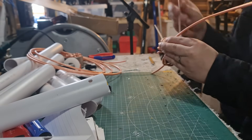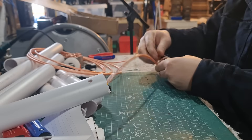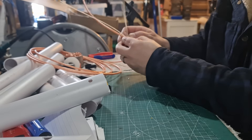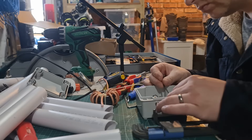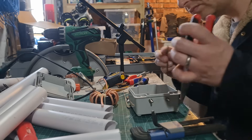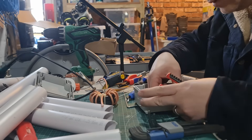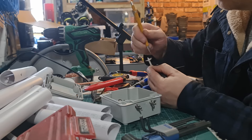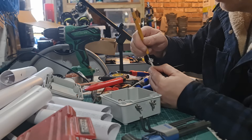Then just cable tie the other tail, before trimming to size and then exposing the inner and outer. I do wish this project box was slightly bigger, so I've put an SO239 in it — put a couple of M4 bulkheads, just tighten the nuts up. This RG400 is quite hard to get the shield off. It's double shielded, PTFE dielectric, so it can handle a lot of power.